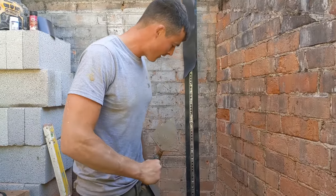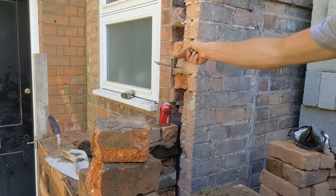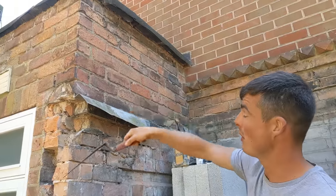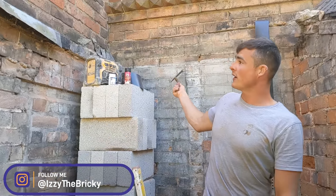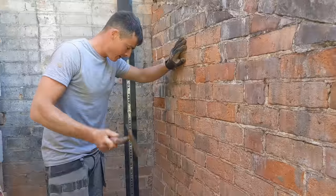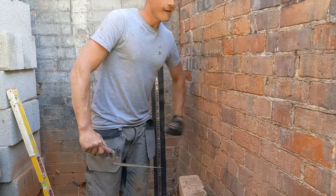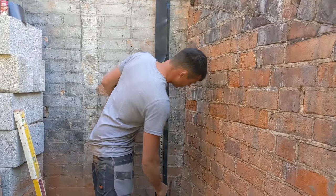I've set this out and I'm just leveling and ranging from this point here, coming around level following this brickwork because eventually we're going to be building on top of that. When I set this up I worked my bond out so I know it's going to work when I go up there. There are three different buildings with different brickwork here, there, and there. This won't marry up to this but it doesn't matter because it won't really be seen. I'm racking back here and going to get some screw-in ties to tie this to that wall, also throwing out triple ties to tie into the blockwork, because the wall curves so I can't fully fix it until I get up higher.